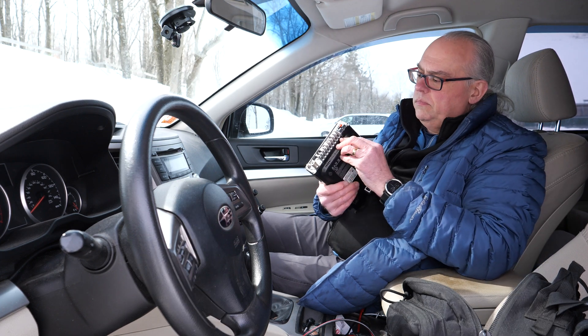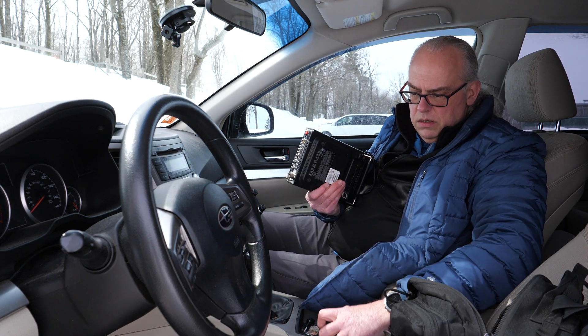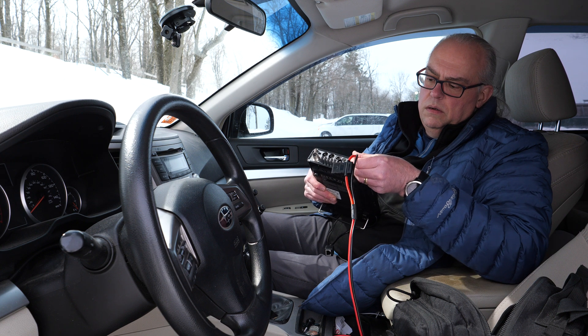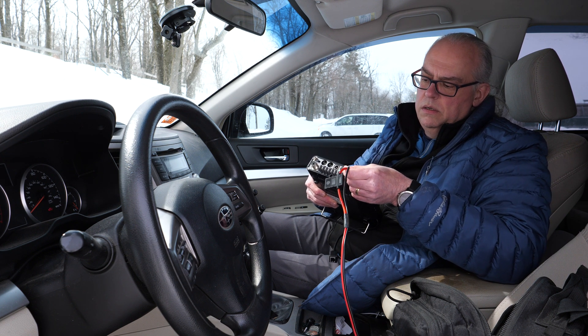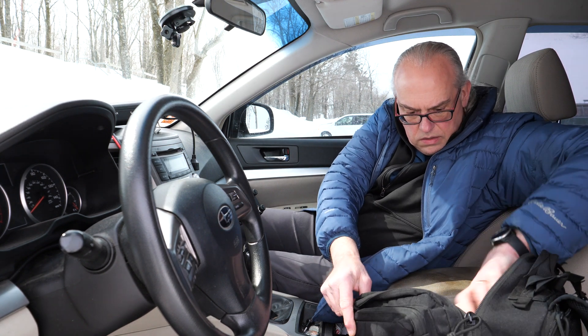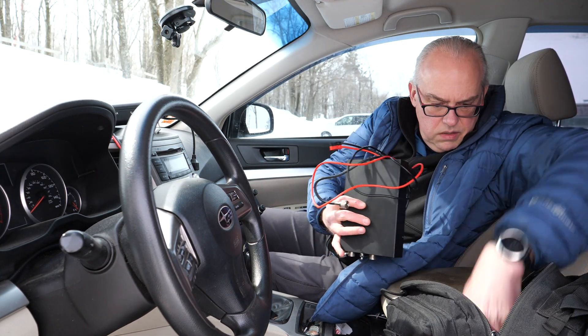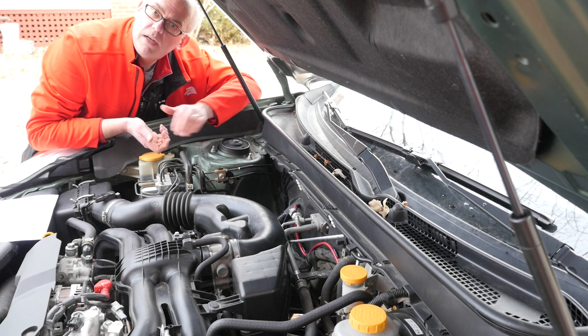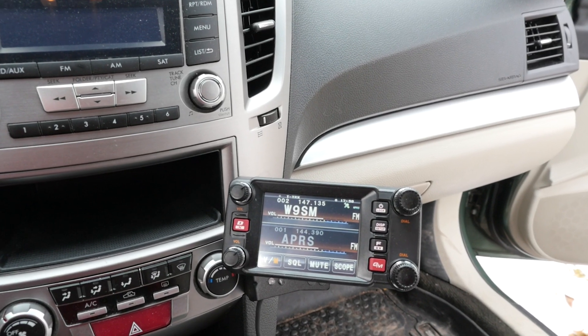For powering equipment, the amperage or current draw is much higher, so I'll use a larger cable. My power connection cables from the battery to the transceivers are all 12-gauge. This handles 23 amps at 13 volts, which is the maximum current draw of my FT-891 at 100 watts in transmit. While I usually transmit at lower power, I did the calculations for the max power I would generate, just to be on the safe side. In my vehicle, I ran 10-gauge cable from the battery to the 50-watt mobile transceiver. I use 12 feet of cable, but at that length it's rated for 40 amps of current draw, which gives me the capability for two transceivers without having to add a second cable. For battery-to-radio connections, it's okay to be a little oversized — just make sure that you're properly fused for the current load of your cable.